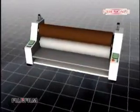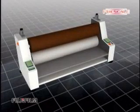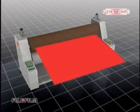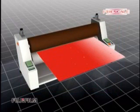Take a look at how Prescale is benefiting the paper or film industry, whether nip roller application involves heat sealing or heat rolling. If nip roller contacts are consistent and the pressure is distributed evenly across the wide area, Prescale can display the consistency and stability of the pressure density. If nip pressure balance is not good or there is any dust or inconsistencies, a gradient chart or some spot dust will be displayed on the film.